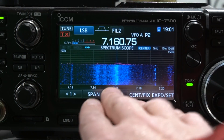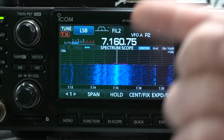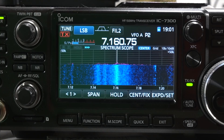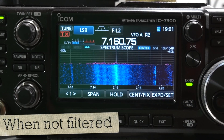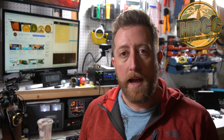You've got major hash here, there's a center frequency from that switch mode power supply, switching back and forth. And as the devices are becoming more efficient, the faster they switch back and forth, the more efficiency they have, but they also put out more RFI. My refrigerator is probably my worst device that I own as far as this hash. It's just incredibly bad.